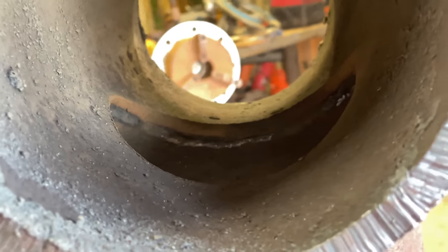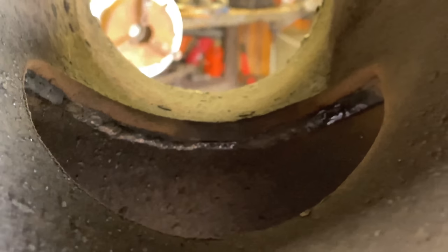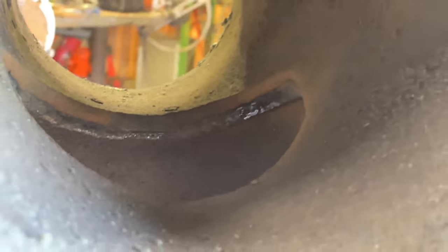Like I said, the fit wasn't all perfect, but all you want is everything to be burned, like all the walls to be burned down and a root in there. Let's go ahead and put a hot pass in there.